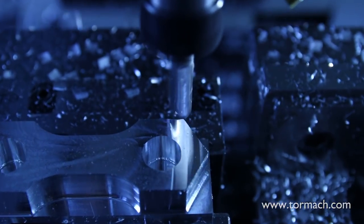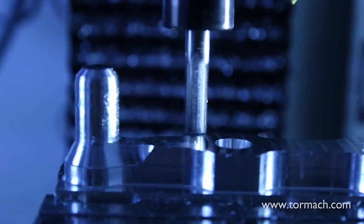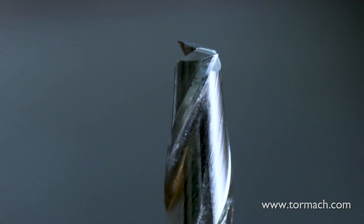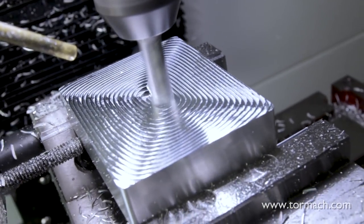While things will get fairly flat, an end mill will still leave tool marks or microscopic height differences, sometimes as small as a tenth or less, that can create an appealing pattern. An end mill often comes to a sharp point at the corner, and the bottom edge is usually at about a one degree angle as it goes towards the center, so it doesn't overlap with the previous pass.